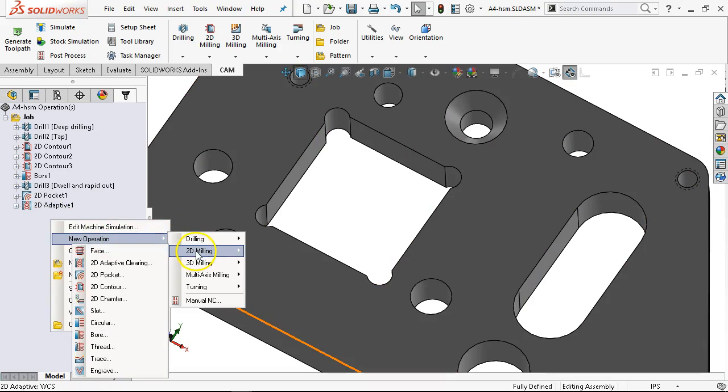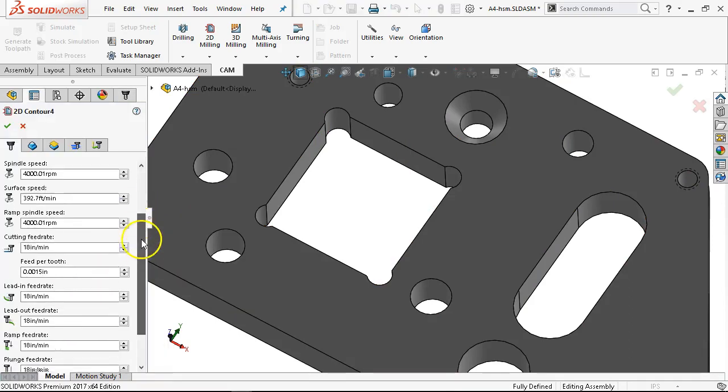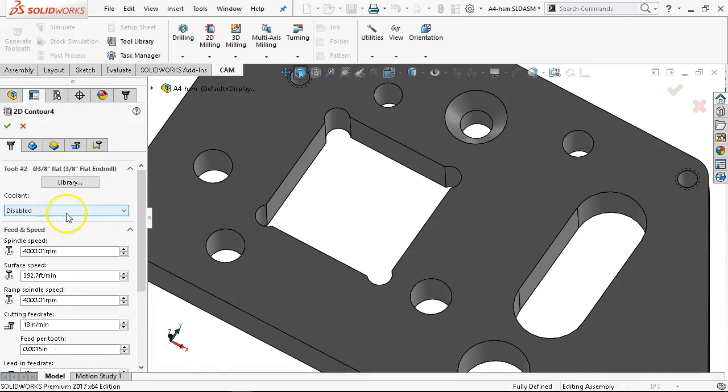Going back in — 2D contour. Can you put the nozzle, besides your coolant, just blowing the holes? Well, on the TM we're standing there with the air gun or our paintbrush, trying to blast the chips out that way. Not all coolant — if you don't get it in the right position there's still the washing machine effect where the chips in the bottom before they're ejected are just getting recut and ground up against the surface. It kind of depends on the machine.